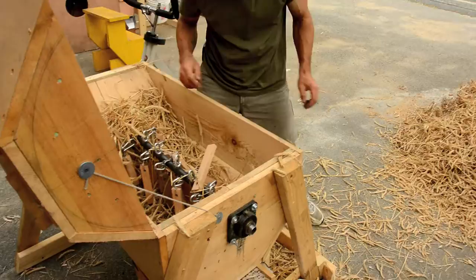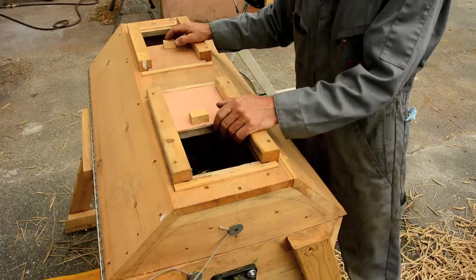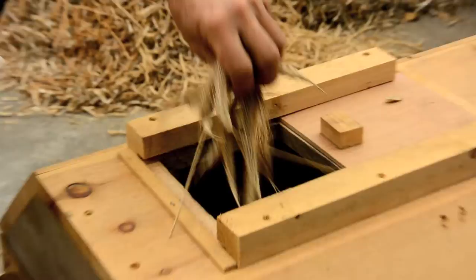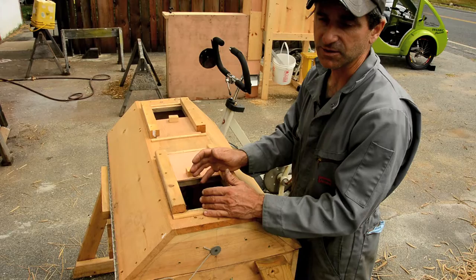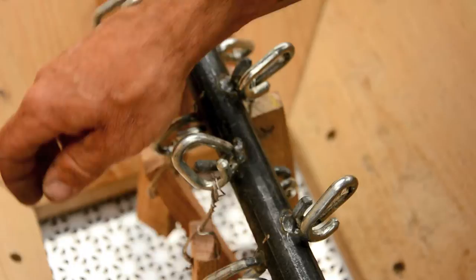There are a couple other possible ways this machine can be operated. If you had a crop like rye harvested with a sickle so that you only had the heads, you could put a hopper here and someone could feed the rye in, and the finished husks get blown out at the other end. You can also put a gradation of flails so that the first flail that hits the heads is weaker, like plastic chain, and then later flails get progressively harder — seeds holding on loosely wouldn't get broken, while seeds holding on tightly get hit out later. For the continuous pass-through method you might want to put more than one flail on each hook.